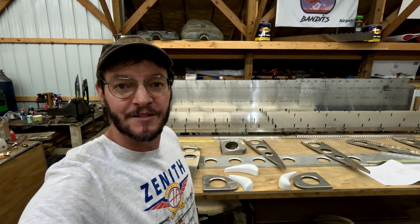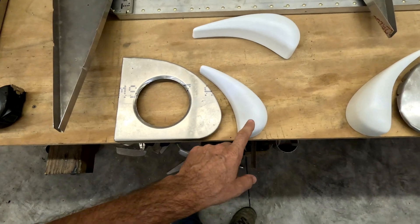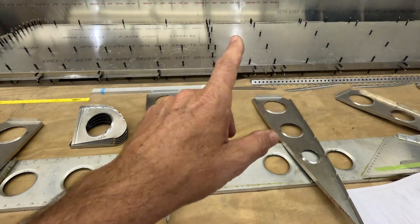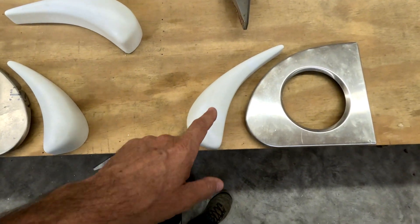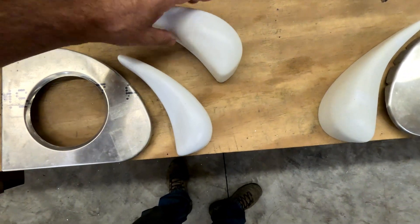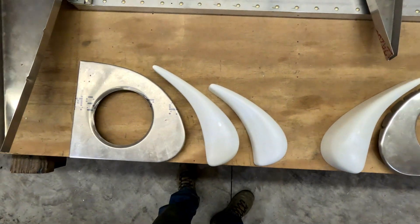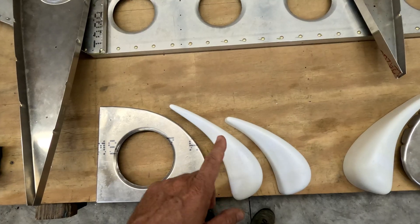There's one question I've got that you guys might be able to help me with. What I've got laid out here — this is a 701 nose rib and this is a 701 slat tip, the fiberglass tip. The super duty uses essentially the exact same profile. These are 701 nose ribs because I already have my super duty nose ribs installed, but they are almost identical as far as the actual size profile. However, these slats are quite a bit bigger on the super duty — it actually curves up further on the nose rib. You can see there's a tremendous amount of difference between the 701 slat and the super duty slat, just in the general length and how much further up it goes.